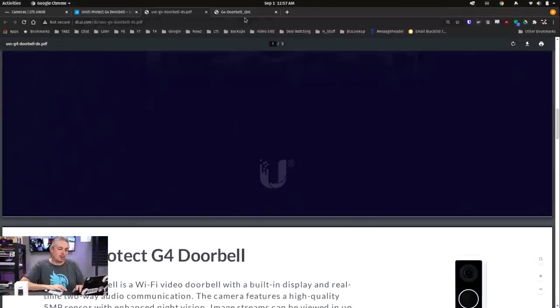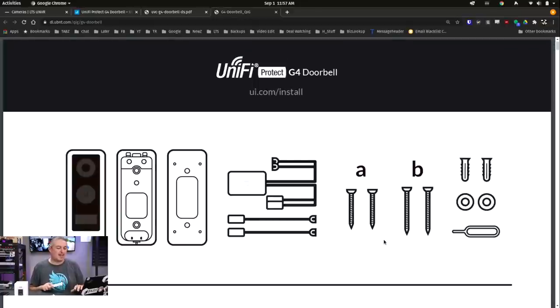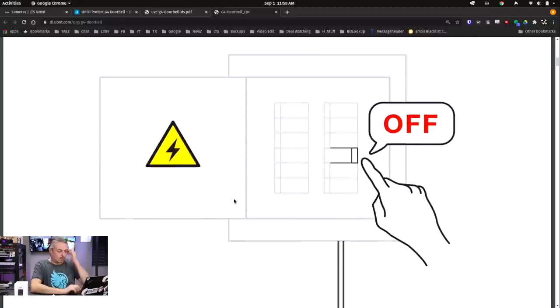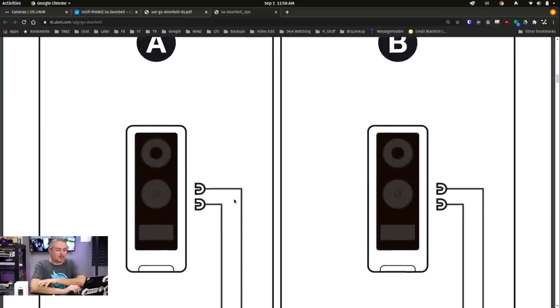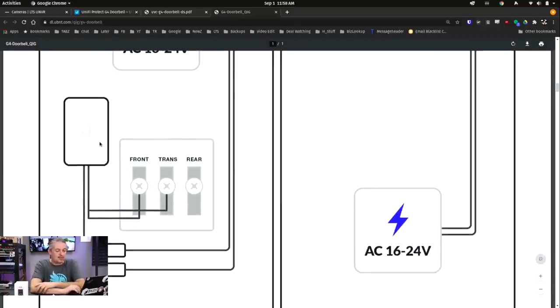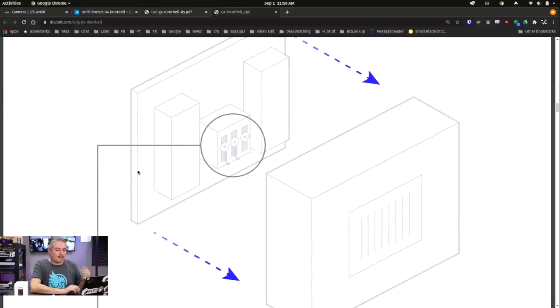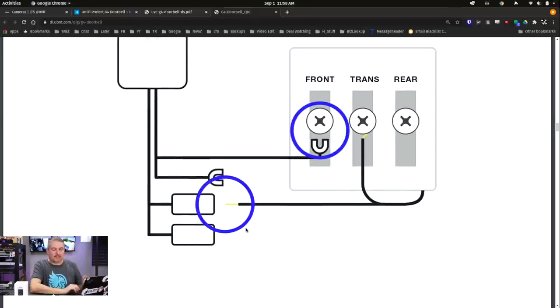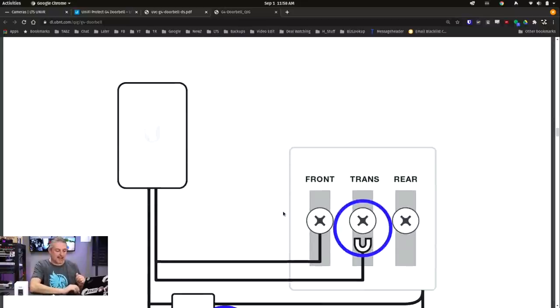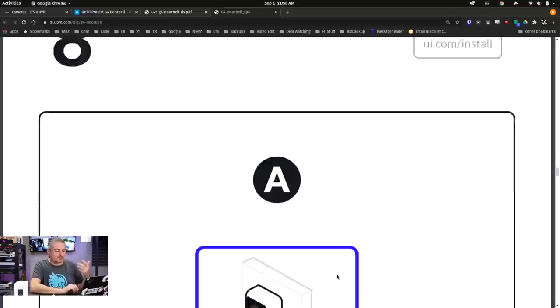As far as what comes in the box — it comes with some screws, a couple anchors, and a little device that, with instructions, allows it to not only ring your phone but also ring an old-style chime in your house. In the instructions, they tell you to cut the power off — definitely do that, don't electrocute yourself. There are two different install options: one is just with the transformer, which is what we're going to be doing since I don't have a chime. If you do have a chime, there's a little device you add on so it will ring the chime as well. They also provide nice little push-in connectors that make it really easy to plug the wires in — much cleaner than screwing wires directly to the back.